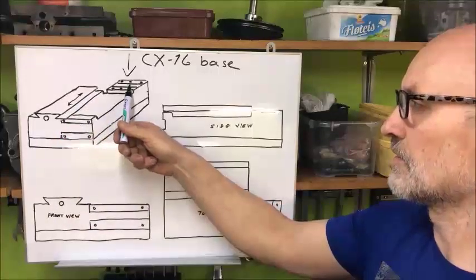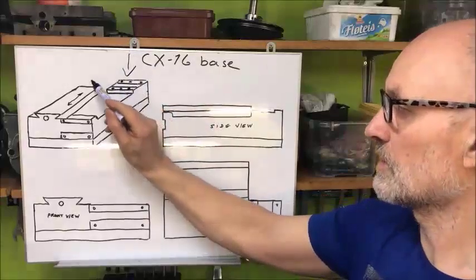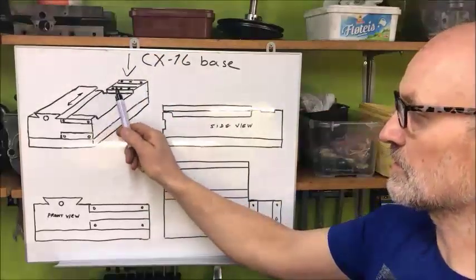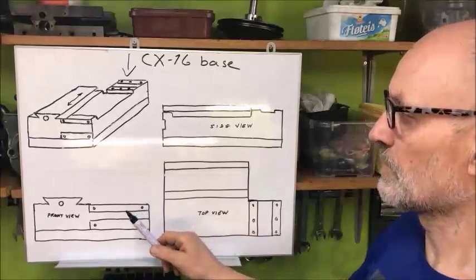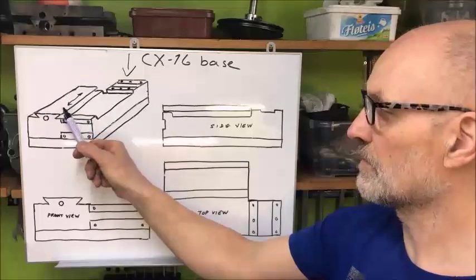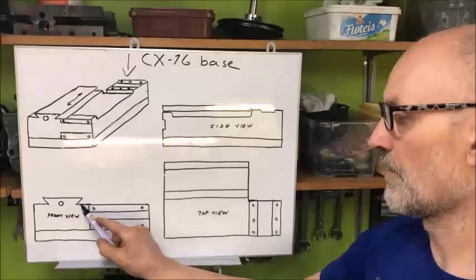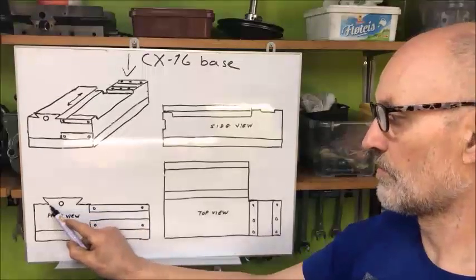This also meant that the base and the tower, or the column, should sit exactly perpendicular — that way and that way. So it seems like these surfaces were in plane. But when tested, I saw that when I moved an indicator from here over to here, and going to the leftmost and rightmost flat parts, I didn't get the corresponding numbers — one of them was higher than the other.